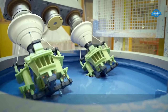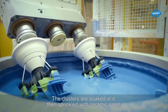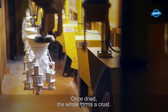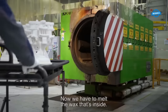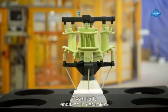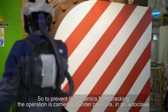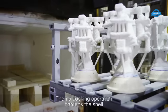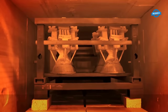To facilitate the casting process, the wax models are organized into clusters, grouping several wax models together for easier handling. The wax models, now arranged in clusters, are immersed in a ceramic slip — a liquid paste that coats them — followed by the application of ceramic sand. This process is repeated multiple times, with each iteration adding a layer of ceramic material until a robust ceramic shell is formed around the wax models.